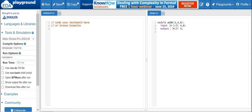We will declare it as wire. It's not a problem, you can declare wire here also. And then, before writing the other steps of code, first we will declare what n is. The simulator doesn't know what n is and how many bits it needs to take, because n is a variable here, so we need to declare n as a parameter. Suppose let us assume it's a 4-bit ripple carry adder. So for now we will do 4-bit only, and then in this tutorial I will show how to add for 20 bits, or how to add for 13 bits. You can keep n number of bits.